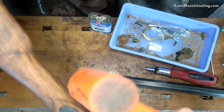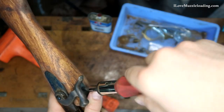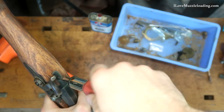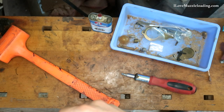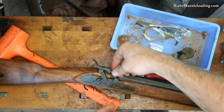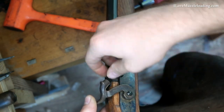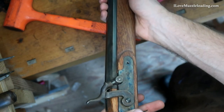Our inlets have swelled just a tad with that oil, and that's why you'll see people say they don't apply any oil or finish until they have everything assembled. Back to what I was saying earlier, it's easier at times to loosen that tang — there we go — to get your barrel in there correctly. To get around the lock plate on the CVA, which is pretty tight, and the drum on the barrel, we had to loosen this up. So we'll drop our extension key in there. And if we wanted to, at this stage, we can take our little nipple here, give it just a dab of oil on the threads. You'll see folks put some Never Seize or other lubrication products into these, just to make sure those threads don't corrode over time. We'll come back in and lock this down with a nipple wrench.